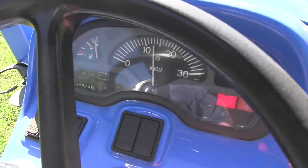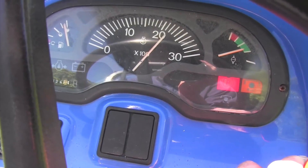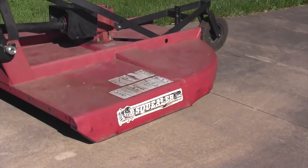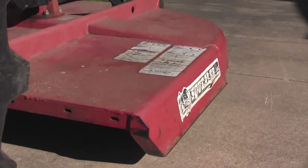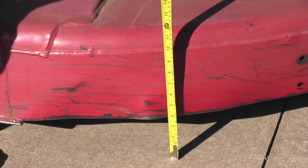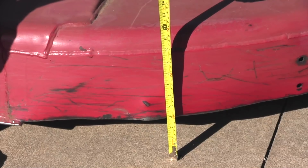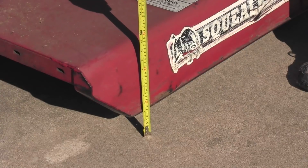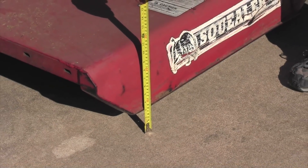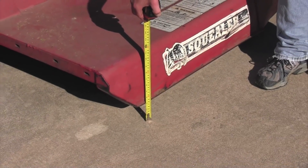If you're mowing too low over rough ground, or you've got too much rake from back to front in your brush hog, you're plowing part of the time — cutting dirt and rocks. Check your owner's manual for the recommended rake angle: how much lower is the front supposed to be than the back? A lot of folks have their cutters way low in the front and high in the back, with blades aimed down going into dirt, which puts a lot of pressure on the driveline. Getting that set right might cure the problem.